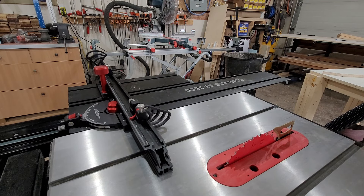It was fairly easy to set this thing up by myself — it does weigh about 80 pounds, but it basically comes in three pieces. Because this sliding table is made by Harvey and this is a Harvey table saw, the holes all lined up nicely. It does have instructions in the owner's manual on how to put this on other saws — primarily the SawStop, for example — but it will fit on any of the others like the General, the Jet, the Powermatic, King Industrial, Grizzly, or pretty much whatever you have, though you may end up drilling your own holes into the side of the table.